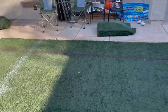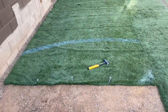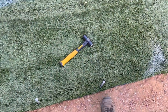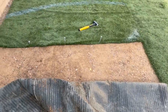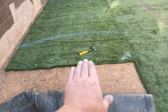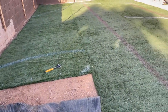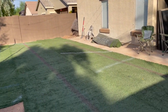That piece is set with spikes here, here, here, here, and here — roughly every 18 inches, not measured exactly. I've got the spikes pretty far to the edge and did the jump-and-stomp stretch you saw earlier. Now I'll unroll the next piece, slide it right up to it — not overlapping — then set that edge and stretch it this way. When I say stretch, you're really just getting out the folds.